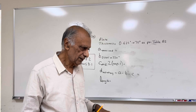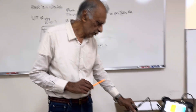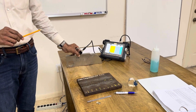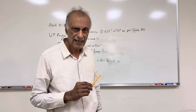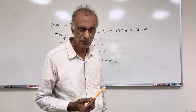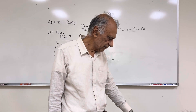The size comes out to be — the one I am using is 5/8 inch by 5/8 inch. That is the UT probe I will be using. Again, you cannot use a 5 megahertz probe. If they say 2.25 megahertz, it has to be 2.25 megahertz and it has to have a certain size. You cannot use a half-inch probe for this inspection. So that's step number one.